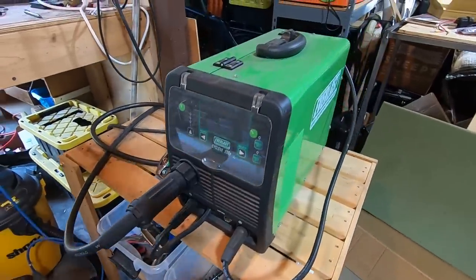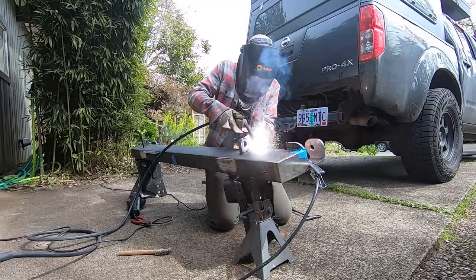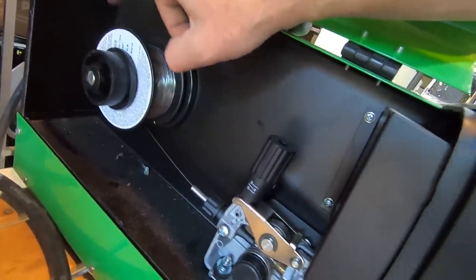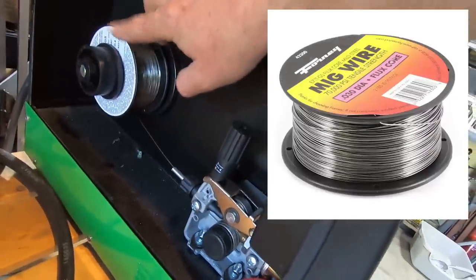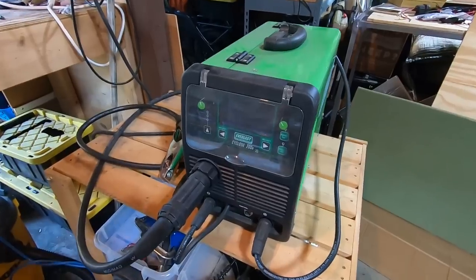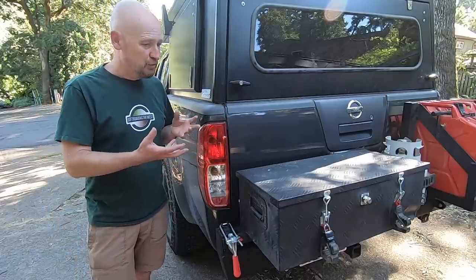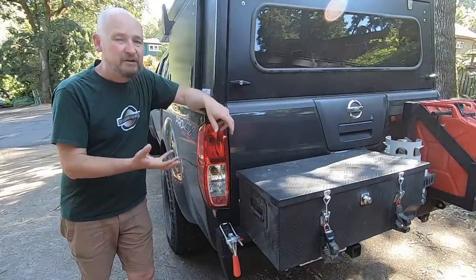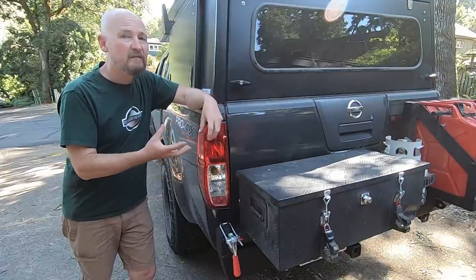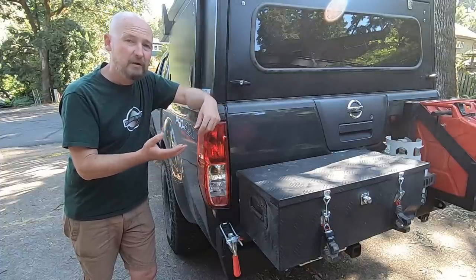I did all the welding on the bumper using this Everlast Cyclone 200E. This is a welder that will do flux core or run gas — I hadn't set it up with gas so I was running flux core. After doing some research I heard a lot of good things about Forney wire for flux core, and when I ran out of the Harbor Freight wire that came with it I replaced it with Forney wire and it worked noticeably better — 100% worth the additional expense. This welder will do 110 or 220 but I don't have a 220 setup here, so I did weld everything at 110. I've had people question whether a 110 welder could get enough penetration for a project like this, but I'm not welding half-inch steel — it's eighth inch, three-sixteenths, quarter inch. I had no issue getting plenty of penetration and could easily blow out the metal if I had the settings wrong. I did run a little strength test using some one-eighth-inch metal.